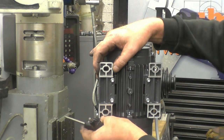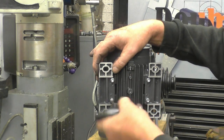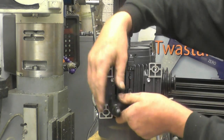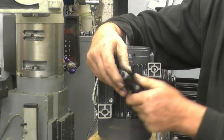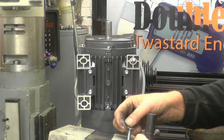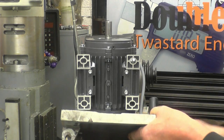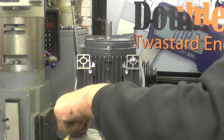There's a little bit of slop on the holes, a little bit of play, but there's quite a lot of movement on the actual mounting holes to get things lined up. I'm going to put the two spacer washers in the bottom that were there originally, just to keep the motor lying at the right angle.